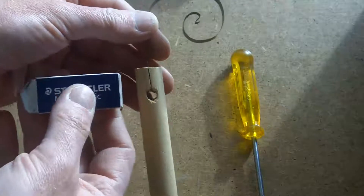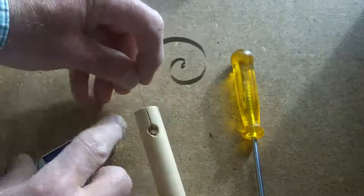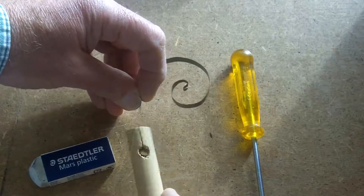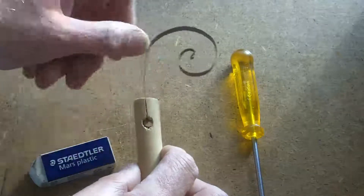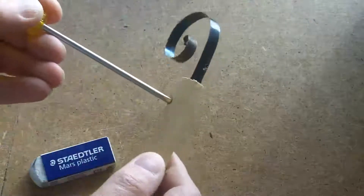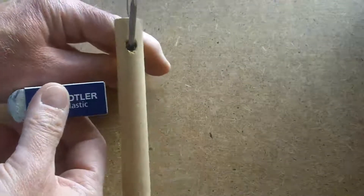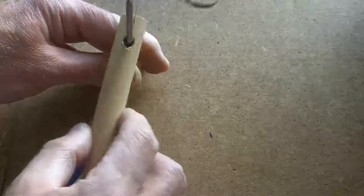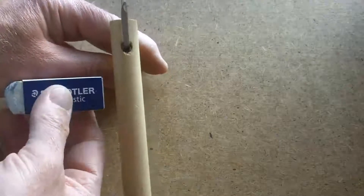The only problem if I use this mechanism and have my magnet here is that at the moment of impulse, it will actually tend to bend the pendulum — exaggerating it — and I think that could set up a wobble. So I think I've got to go to some more positive sort of bearing, maybe something like that, so that when my magnet operates, it doesn't have this sort of bending effect on the pendulum suspension system.